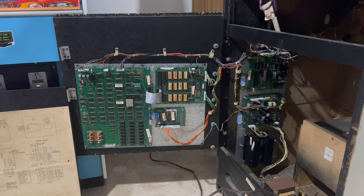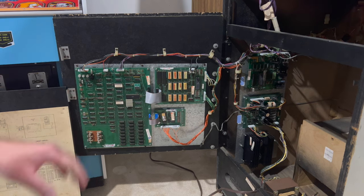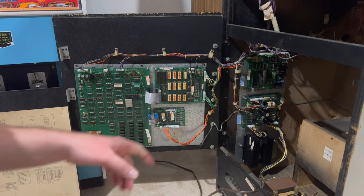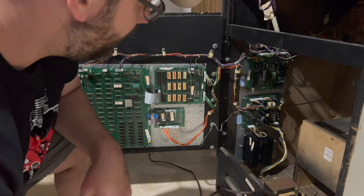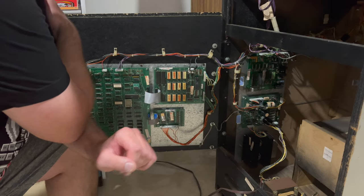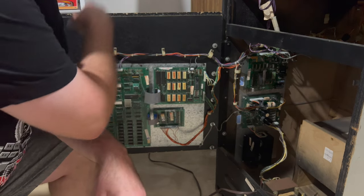We've got five different PCBs running the show. First up, we have the video board — the main board with the CPU and all that stuff, which is common between most games. This originally took three AAA batteries to power the memory that saved the high score; I've replaced that with an NVRAM modern replacement. Then we have the ROM board with all the game code — the ROMs are unique for each game. There's an interface board that handles the controller inputs. On the inside of the cabinet, we've got a power board and a sound board — and this sound board is where I think I'm having this issue. Williams also made pinball machines, and these sound boards were common between a lot of their pins and video games. Down at the bottom, we have the isolation transformer, and the monitor up at the top.